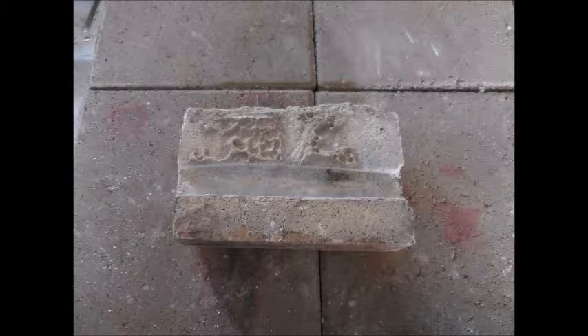Let's also look at the tools we're using. One of the most important is our work surface. Obviously, since we're working with heat, we want a surface that won't burn. That's why I've topped my work surface with these pavers. If you're going to do that or use any surface that's a bit porous, make sure it's dry before you start using your torch. Any water in the pores of the paver can easily be turned into steam by our torch. Steam in a confined space can create an energetic reaction — and we're here to do metalwork, not to treat shrapnel wounds. It would also be nice if the work surface would reflect heat back at your metal. That's why I work on this fire brick most of the time. This channel cut into the brick is useful when I'm making knife blades or steel stamps, because it reflects heat back from the sides as well as the bottom.